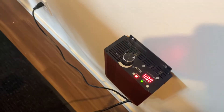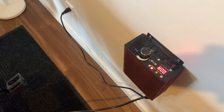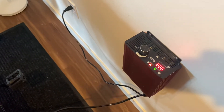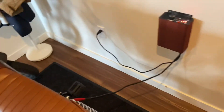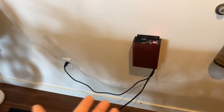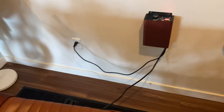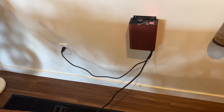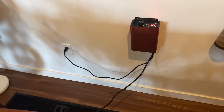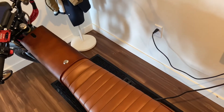For example, if I turn on the actual charger unit itself it won't even let me put in an amp because the battery is full. But if I had say 20% room to charge, it would cap me at 3 amps — so it only lets you charge in a way that won't destroy your battery. When your battery is totally empty you could technically put it at 12 amps, though that wouldn't be ideal since this battery is capped at a 10 amp rating.